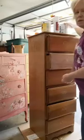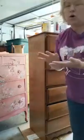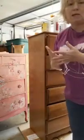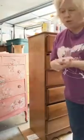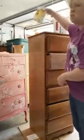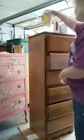It just depends. Knowing whether you need to prime or not just comes with experience. If you don't know if something needs to be primed, if you have a slick or a really old piece, then you want to prime. Let me just say this: it is never, ever bad to prime. You can never, ever go wrong priming. And if you want to see your wood underneath, then you need to use something like clear shellac, okay?